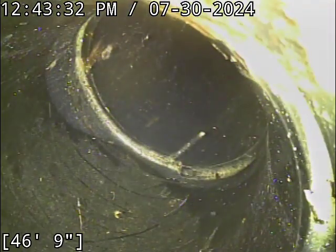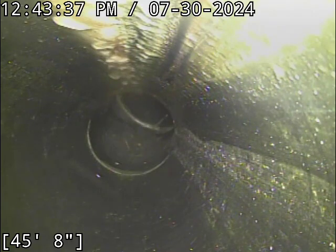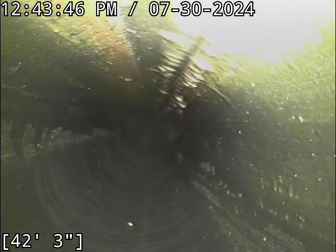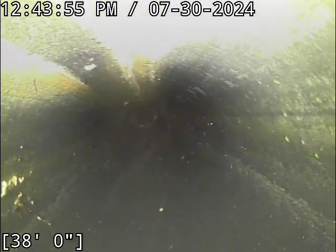And a big hard dive here as you drop down to the concrete pipe. The downside of a drop like that is, anytime you do a nosedive of that fashion, your likelihood of getting a belly is much higher. Honestly, sometimes there's not a lot you can do about it, but in a lot of cases, that's a sign of kind of a lazy install. Ideally, what you do is a nice gradation all the way out. You want to avoid as many of those nosedives as possible because you're wasting a lot of your slope and grade.